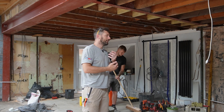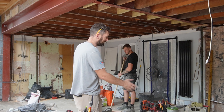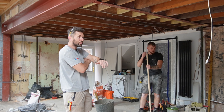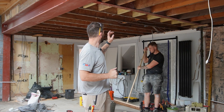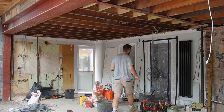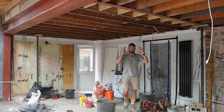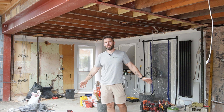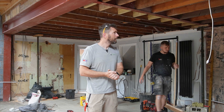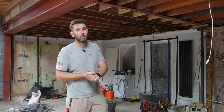That's it for me today. Lou is kindly doing a bit of sweeping up. So far I've got the ring ran in this room pretty much, all the old stuff is gone. Just behind Lou is the hallway running down to the consumer unit at the front of the building, so we'll put the new ring tails here. I need to open up the ceiling all the way down and run a channel so I can get that back, but there's a lot of stuff that needs moving prior to that. It's been a very busy day going through all the plans - a little bit slower than usual. Hopefully join me tomorrow where we'll get on with more cable installation and go through the downlights. Thank you very much for watching, hope you enjoyed it and we'll see you on the next one.